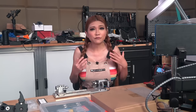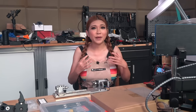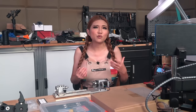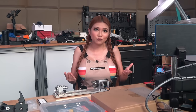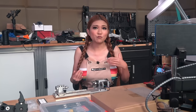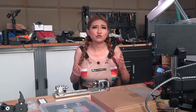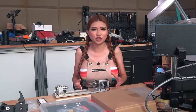Now, as a rule of thumb, when you buy your first milling machine, they say double whatever you pay for your machine to account for the cost of tooling. I think that number really reflects older manual Bridgeport style milling machines, but there is still some truth to it. Be it software or physical tooling, sometimes a dedicated computer to run whatever crazy proprietary software the thing comes with, you are still looking at a lot of extra money on top of your initial purchase price before you get full use out of a typical machine.